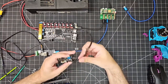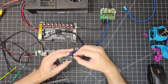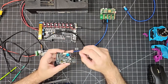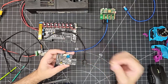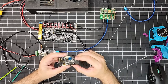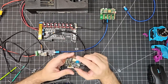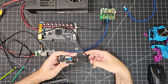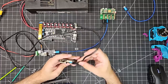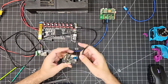Before I do this, as I mentioned on the website, I need to remove the 5-volt jumper that I had previously, because I no longer am powering the board over 5 volts. I'm going to power the board via the CAN bus loom. Everything else should stay the same. Make sure you get this orientated. It only fits one way, so it's hard to mess up. But when you plug it in,